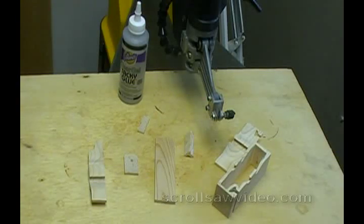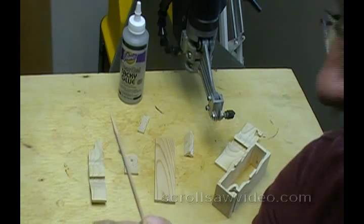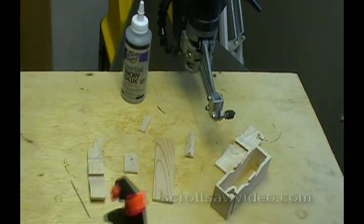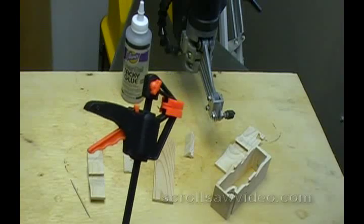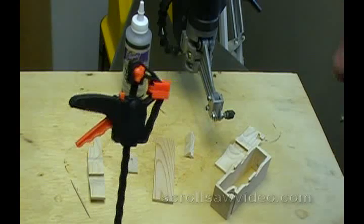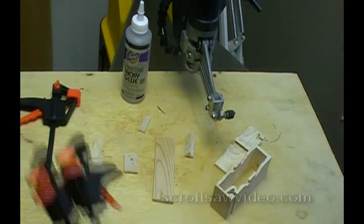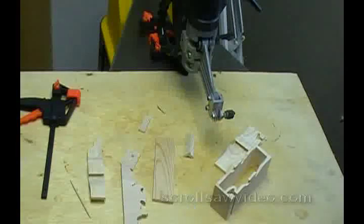Next thing, I'll need to get a glue spreader — here's my glue spreader, which is a simple toothpick. And I will need some clamps. I like using these four-inch bar clamps. You can use spring clamps, Jorgensen clamps, just whatever you have around, but I prefer these. For this size box I'm going to need three clamps. And the last thing I'm going to use is just a little piece of scrap wood to put my glue on.